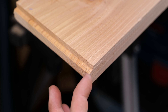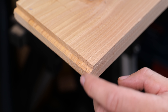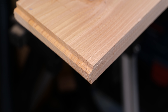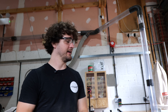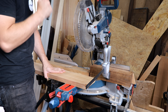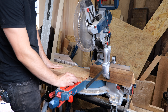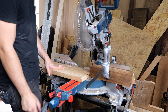There's the result — there are a few steps in it, but I'm pretty confident that's not down to the stop. I've got an alternate top bevel blade on here, so it's basically two pointy knives cutting into the edge and it's not flat in the middle — it will always leave some sort of step. Looking at this mitre saw technique though, it took me ages to do literally a centimeter on the end, whereas a bandsaw would just rip straight off. I think there's still potential for using this setup to cut the shoulder lines, because I'd rather get them straight off the saw than chisel them out. So I'm going to skim off both sides of the tenon here, pre-cut the shoulder, and then rip the cheeks off on the bandsaw — a hybrid between the two machines.